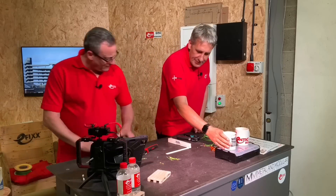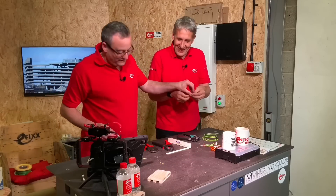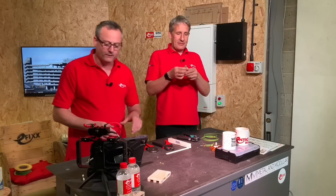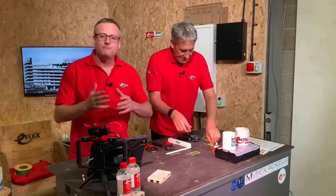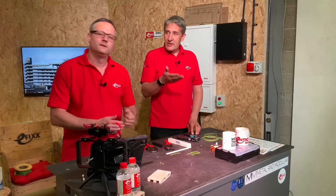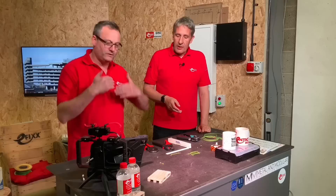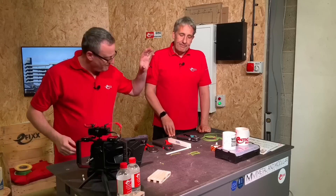If you don't know about the ferrule colours, download the chart in the link below and check out the video we made on it. I would suggest — for the occasional crimper these are good crimping tools, but if you're sitting in a panel doing lots of the same type of termination, you might need to change the magazine over for different cable sizes. But we're talking about sitting in a panel doing maybe a hundred 1.5s or a hundred 0.75 — crimp, crimp, crimp, connect, connect, connect. That's going to be the absolute winning tool.